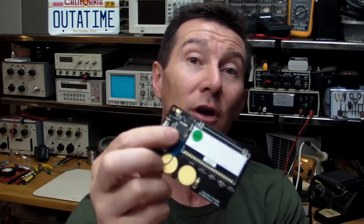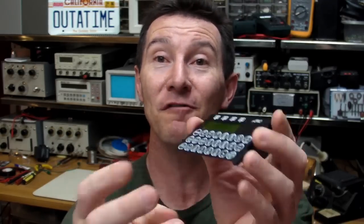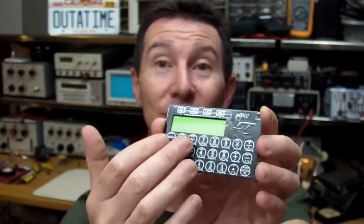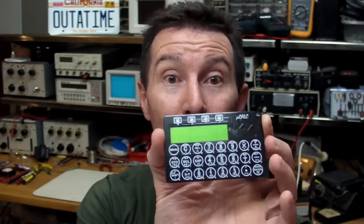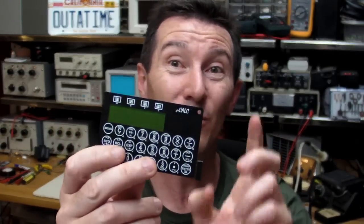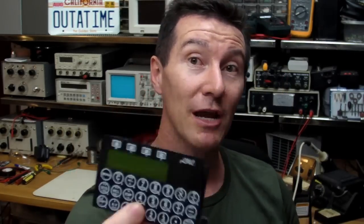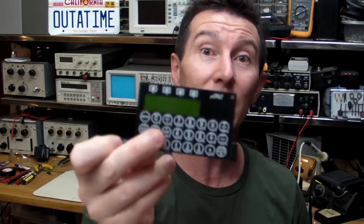The other big decision was the microcontroller's capacitive sensing capability, because I couldn't put physical buttons on this thing — they're actually touch-sensitive capacitive sense buttons. This Microchip PIC chip has built-in capacitive sensing technology, so I didn't need an external chip. I was going to use one of the Atmel touch-sensitive chips, but they were expensive and increased parts count. The number of keys was limited by size and by the number of capacitive sense channels available on the Microchip part. It also had more than enough power to run chess — the world's only chess-playing watch used the same micro, and users actually wrote a chess program for it.